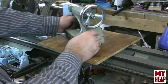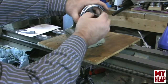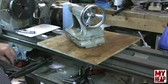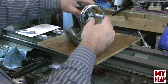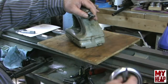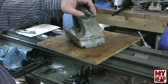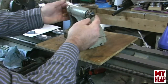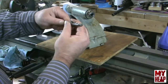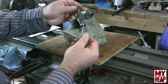Remove the handle — there's a lock nut. Just break the lock nut loose and take off the jam nut. And then there's a key on the handle, so I'm just going to put it to the top and slide this off. So the handle comes off, and then there's a Woodruff key. The feed screw will then slide out. There's a heavy washer here; I think there's probably a burr or something on mine, so I'll take a look at it later when I clean it up.